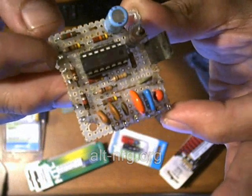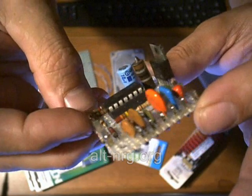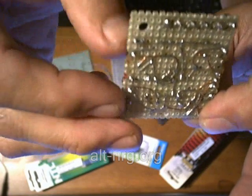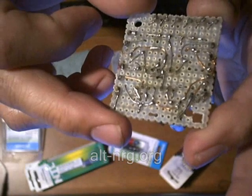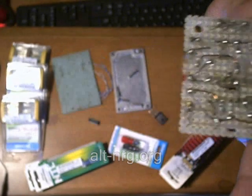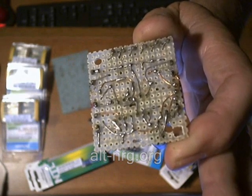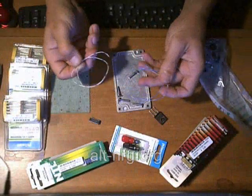Here's the close-up of that prototype board. You can see the terminals I used to make connections to the edge of the board very easily — they just push through the board and are soldered at the bottom. Underneath the board you can see how I simply soldered the components point-to-point as if it were a printed circuit board. Some of the jumper wire I use is just copper telephone or networking wire that we use on punch-down blocks for making connections to 25-pair and interconnecting pieces of telecommunications equipment.